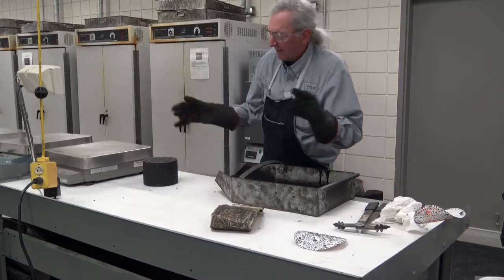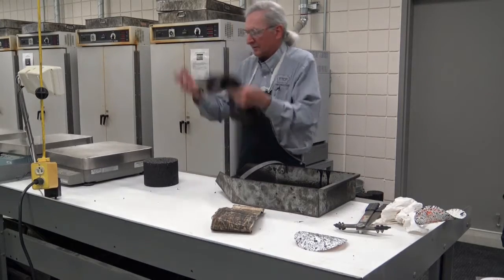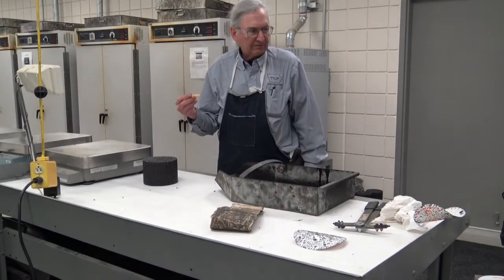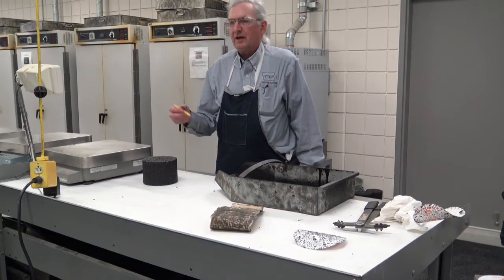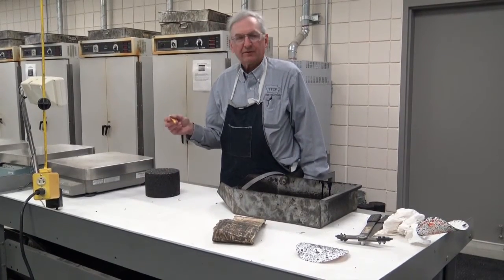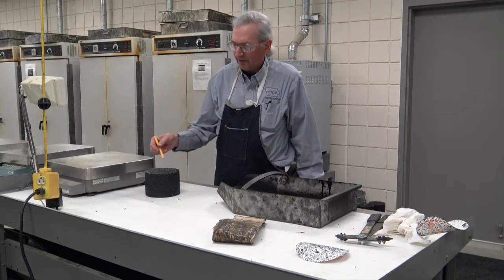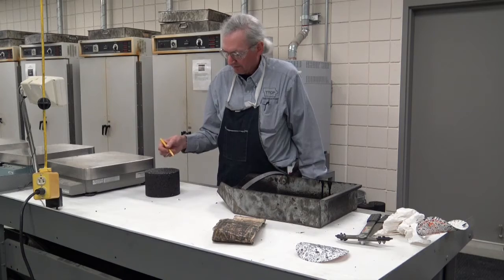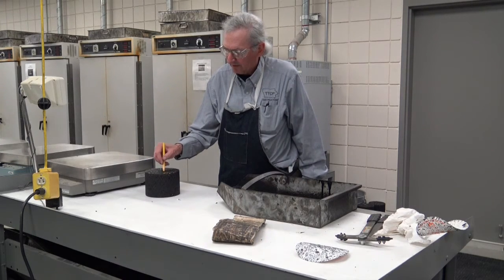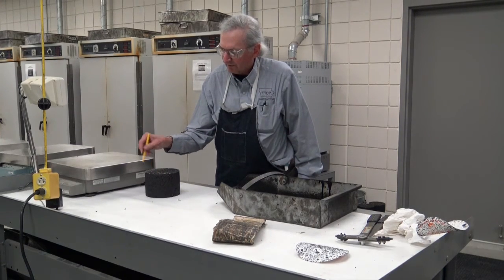A lot of people have cooling equipment with fans to facilitate cooling these off as quickly as possible — fans that blow up, down, or sideways. You also need to identify the specimen. If you're actually working out in the field or in the lab, you need to have a system for identifying your gyratory specimens, because you're going to end up with a bunch of them sitting around. You can't throw these away until the lot has been accepted by the Iowa DOT lab, so you have to have some sort of numbering system. For example, if it were report number five, the fifth day, you might put a five — and then what specimen for the day that it is, in this case five-one.